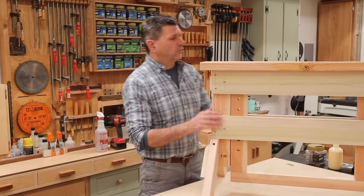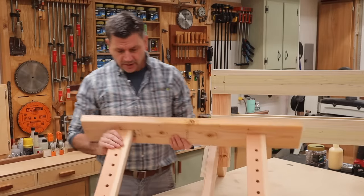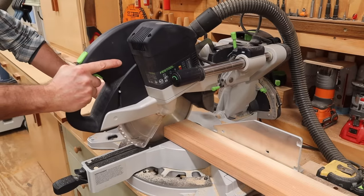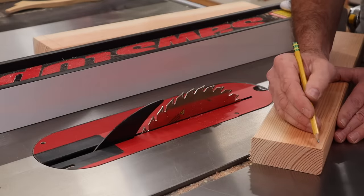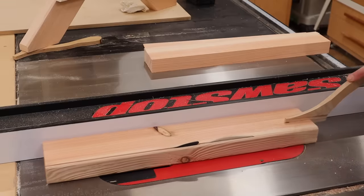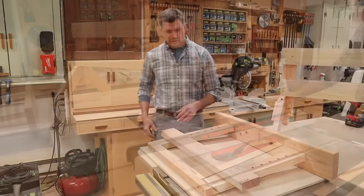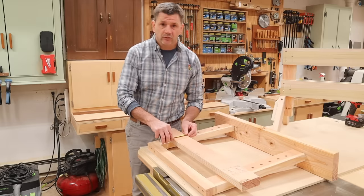Now that I've finished with the base of the horse, let's move on to the adjustable frame. I'll get started with these two pieces — I'll need two pieces of 2x4 cross cut at 20 inches. Next I'll use the table saw to take a quarter of an inch off each side of the 2x4 to square it up. For the bottom part of the frame, I'll need a 2x4 cross cut at 24 and 11 sixteenths and then rip it at two.